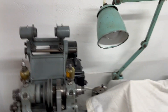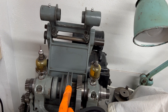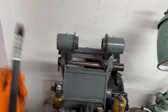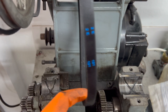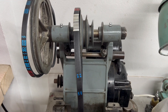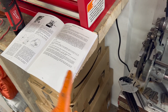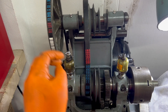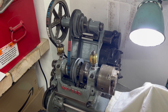I have the counter shaft off. I have my new belt from Myford and I'm going to pop that in, put the counter shaft back on with the pulleys, and then tackle lifting the spindle off. Jumping forwards a bit: I have the spindle out, there are the two bearing caps, and I have the spacers marked. The belt didn't quite fit around so I had to move it down a bit — that can be adjusted afterwards. Hey presto, two belts on. I've followed the ML7 owner's manual to adjust the tension correctly on both, given it a test run, and I'm really happy. Let's get the safety guards back on.